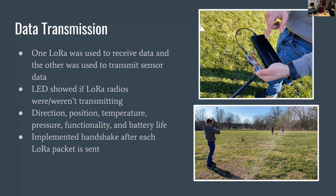Then there's this base station that I assembled. It's on a breadboard glued to this battery pack so that we can walk around in the field. We can just attach it and walk around simply like this. These are connected together via these LoRa antennas. There's a LoRa transmitter as we're installing here. Here's this antenna on this breadboard, and they're communicating in LoRa.